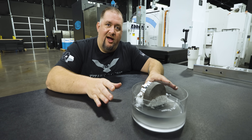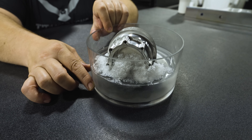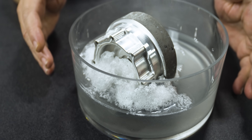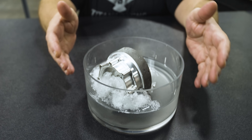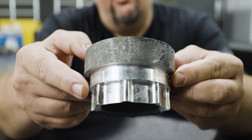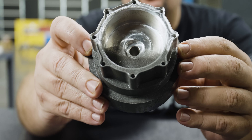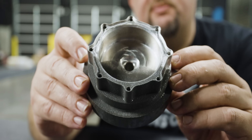We let this sit for about five hours — let's see what we got. You can see all those bubbles, caused by the oxidization process of magnesium in water. A lot of those bubbles are hydrogen, and this is why you don't want your part sitting in water-based coolants overnight — it builds up hydrogen which can start an explosive fire. The top of the part that wasn't submerged still has a very nice surface finish, but the part that was submerged underwater is terribly corroded. This is why you don't want water-based coolants or water sitting on your magnesium parts.